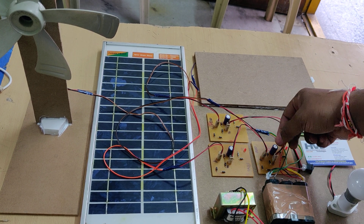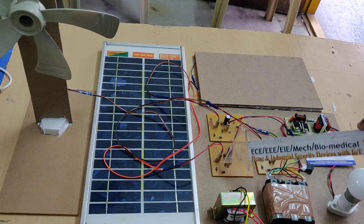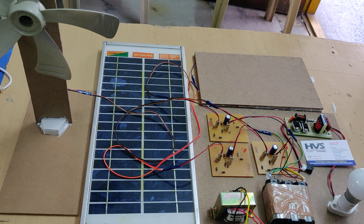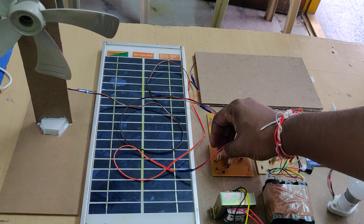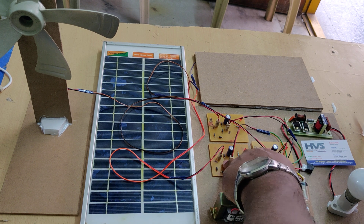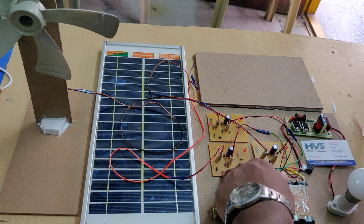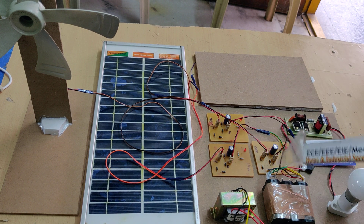The output is connected directly to the battery. The same applies for the solar panel, but the solar panel generates in only one direction. These 4 diodes act as polarity protection — if the solar panel is connected in reverse, the plus would go to the minus of the battery and damage the solar panel. To protect against this, we use these 4 diodes. Even if connected in reverse polarity, the output will always be plus-to-plus and minus-to-minus.